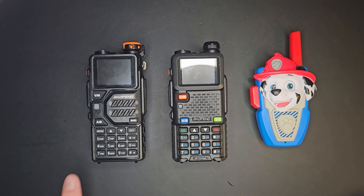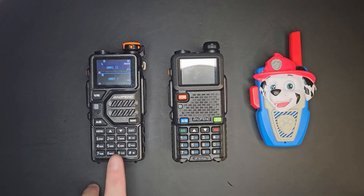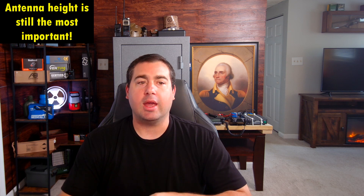Another big benefit of picking an amateur ham radio is the additional power. Someone even claimed that a Paw Patrol toy radio transmitting GMRS at half a watt will go just as far as one of these ham radios behind me at 10 watts — that is absolutely not true. The added power does help. Once you hit a mountain it'll stop your signal, but in the woods or in a city, that power pushes and floods your signal through things better. It's not about maximum range — it's about pushing your signal through dense environments.